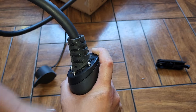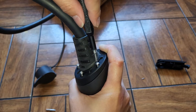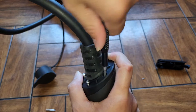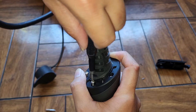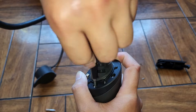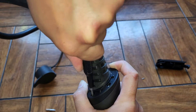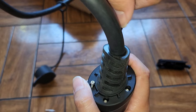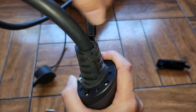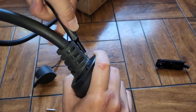I need to switch screwdrivers. Sorry for that useless boring video. Maybe it will help somebody. If you noticed, I always twist the screw backwards first until it clicks in place — that way I make sure it goes through the same threads and doesn't create new ones. That is very important especially when working with plastic or metal things, because you don't want it to create new threads and destroy the place the screw goes into and weaken it.